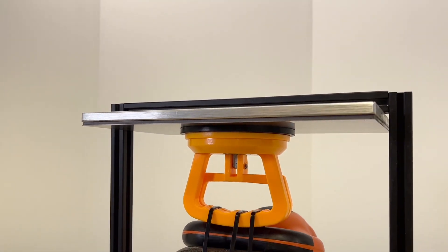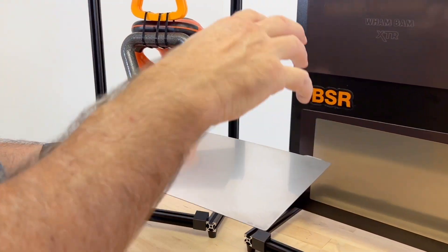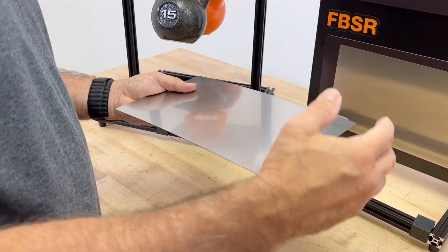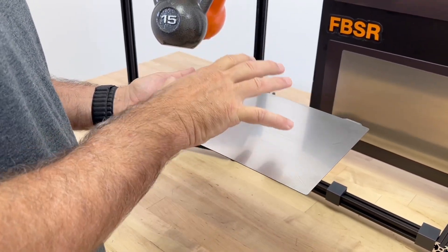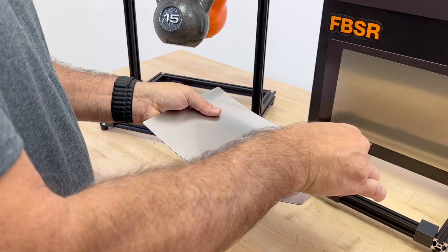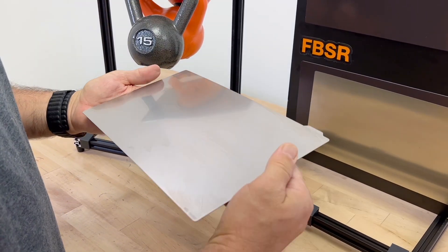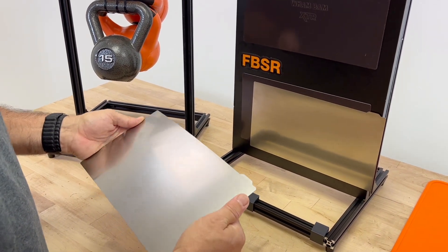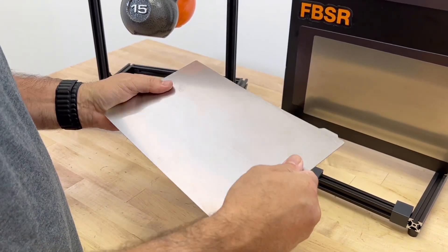A couple of words of wisdom: you'll want the XTR when you're printing very large, full-volume prints. The extra texture on here is going to provide a stronger grip. The stiffer flexi-plate will let you print full-size prints that have a tendency to shrink as all resin does when it catalyzes. One of the problems is when you print a full-size print and it's shrinking, it's going to want to curl the flexi-plate up — the XTR will help resist that. The 3mm magnet keeps it in place, so this is great for large prints, and you're able to flex it enough to get the parts off. Your problem might come with very small prints, where it doesn't flex enough and they're harder to pull off.